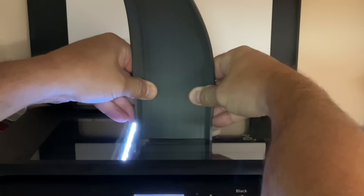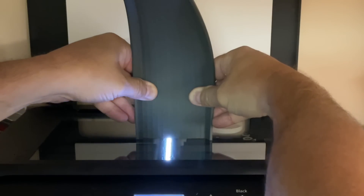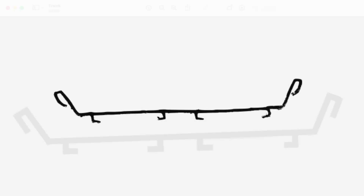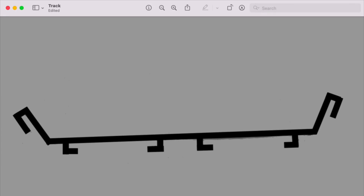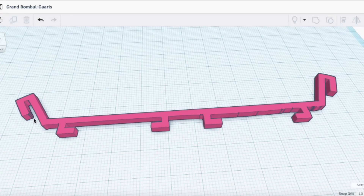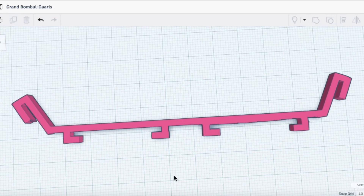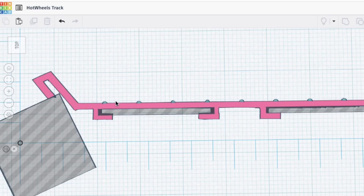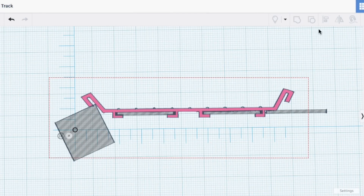I've used a paper scanner before to make 3D prints and I thought: why couldn't I scan the edge of this track and reproduce it? And this was the result — but very sketchy. So I brought it into a graphics editor, used the scan as a guide, thickened up the walls, then exported it as a .svg file, brought it into Tinkercad where I could clean it up further, resize things, and added bumps on top like the original track had.